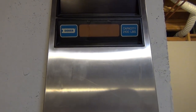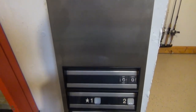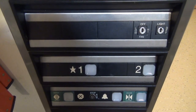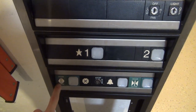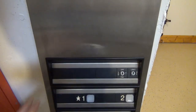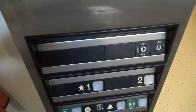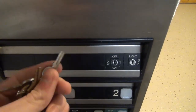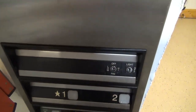We're obviously not going to be modernizing our elevator to a ThyssenKrupp because we like Dovers. Moving down the panel, we have a lot of metal — not a whole lot to see here, but typically sometimes they'd stick things on here. And that brings us down to the buttons. This is an 80s Dover Impulse — we can see that by a couple things: we have the blue door control buttons and the old micro switch keys. We're also missing fire service. Up top we've got three little spacers and then the two keys.